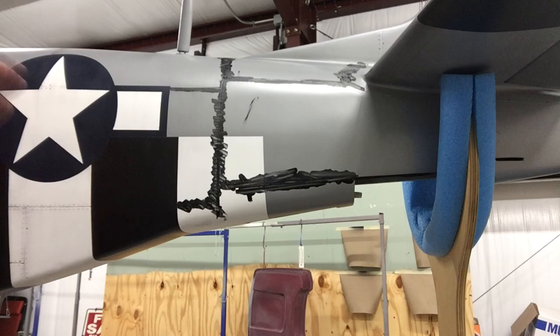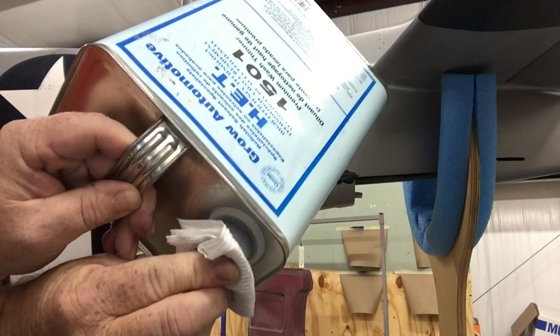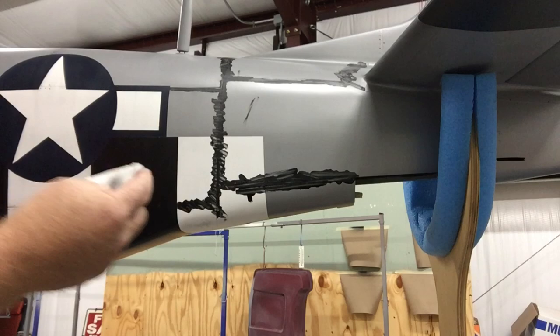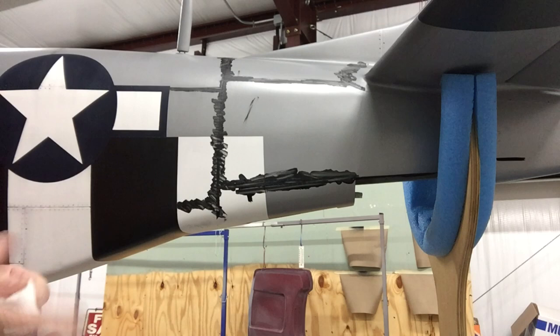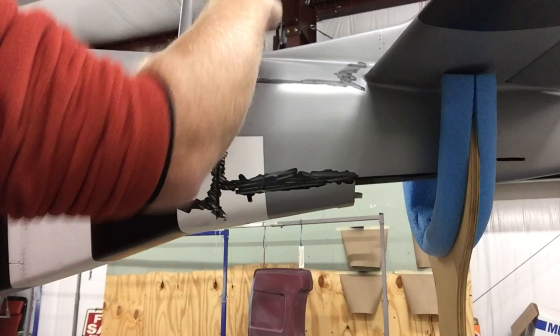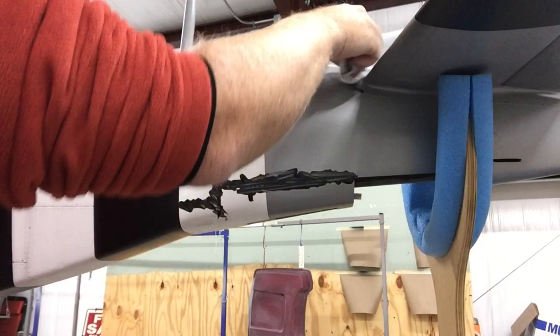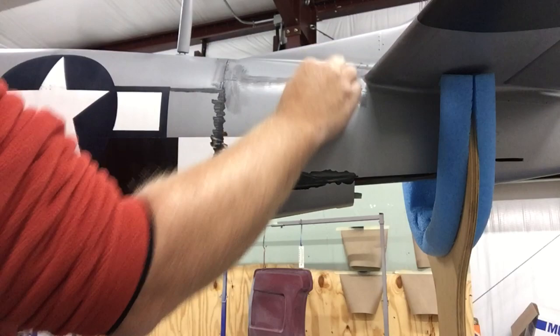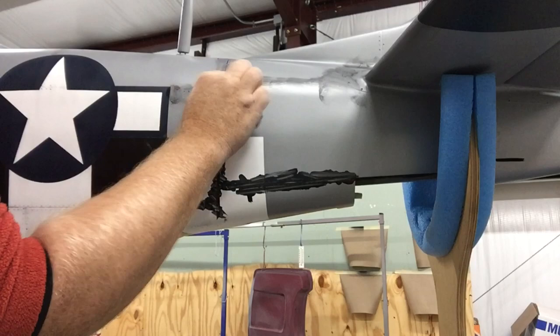The next process is just a simple paper towel. We're going to take our lacquer thinner and wet it really well. Now if it's too wet — see it coming out? — that's too wet. It's got to be drier to make this work. You might have to let it sit or use another towel. Otherwise if it's too wet, you're going to take everything off and we don't want to do that. So we're just going to start up here. Remember what we're trying to do is rub it in — rub all this into every nook and cranny. The dirtier the towel gets, the better it works for you.